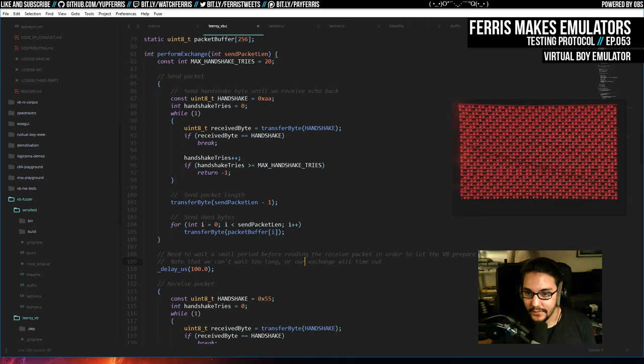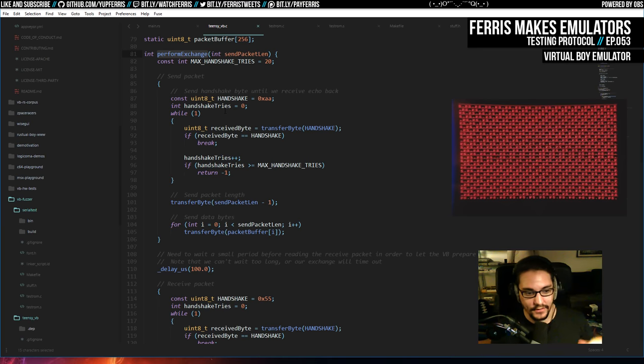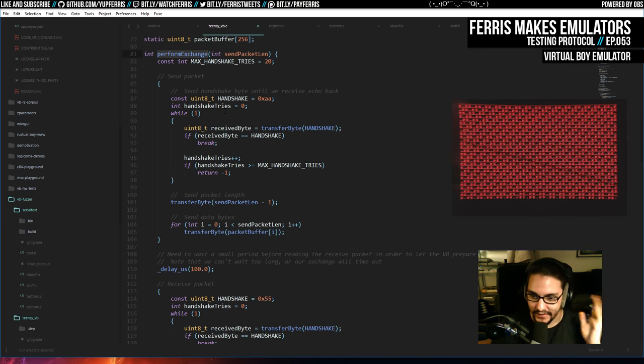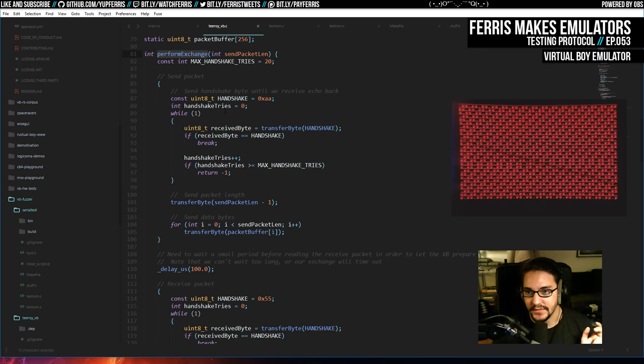Totally forgot about that. But anyway, that was basically all I did. It's just now I have these max handshake tries and these exchanges. So I call that in the protocol. You always send a packet from the host and then receive a packet back from the Virtual Boy. So I call that an exchange. That was the main thing that I changed.